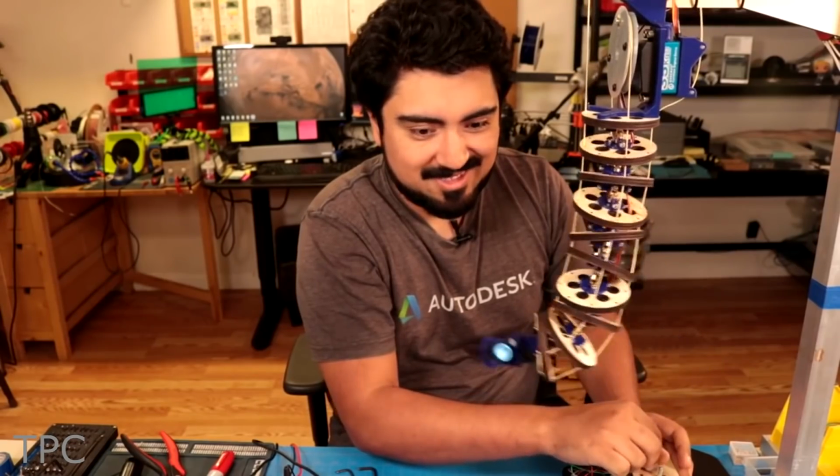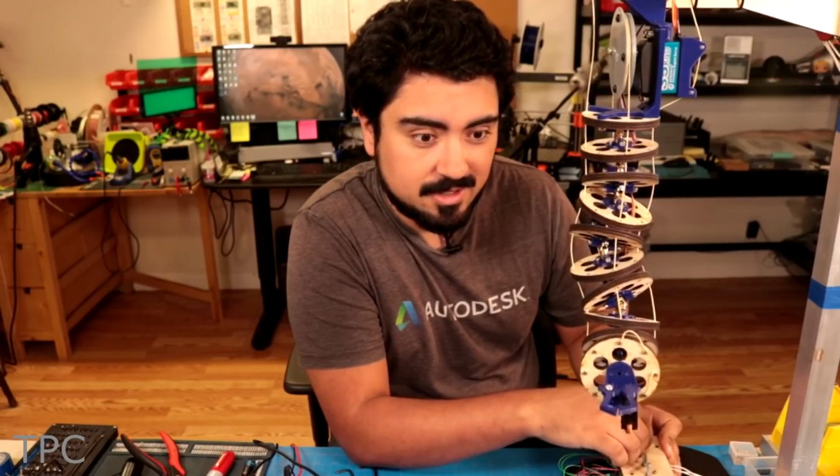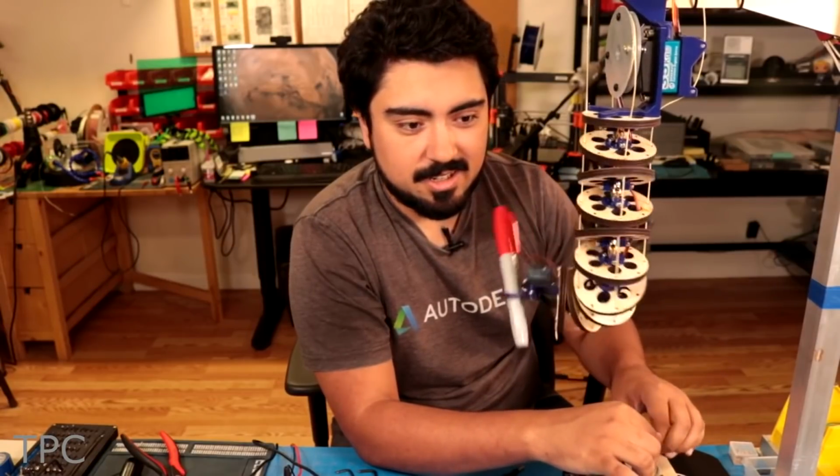The movement of the arm is controlled using 3 servo motors, where each can be controlled individually using potentiometers. 2 potentiometers control the arm movement in X and Y direction, while the third potentiometer controls the claw to hold the objects. So, will you include this project in your to-do list?